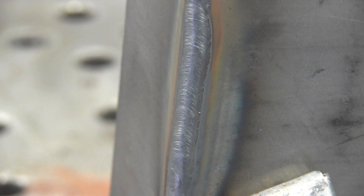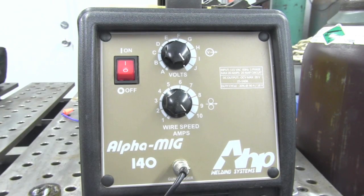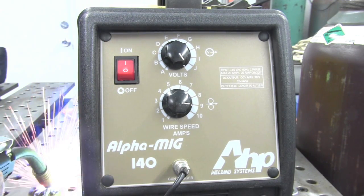If you listen to this closely — you can hear a slight stutter in that arc. So I increased the voltage just a little bit and it got rid of that. Now it's ultra smooth, no stutter at all — just a nice smooth bead. So that's downhill eighth-of-an-inch metal. Eighth of an inch is about as thick as I want to go downhill, but that's a whole topic for another day. I'm going to go to a quarter inch and pretty much try maxing everything out and then weld on this scrap piece and see where I need to go. I'm at max voltage and max wire feed and it sounds like I have too much wire feed speed, so I'm going to bump it down just a notch. I hear it stuttering a little bit — stubbing — so I'll lower the wire feed speed just a little bit again, and then that seems like it's going to be a fairly smooth arc.